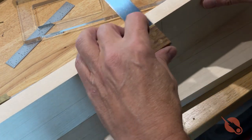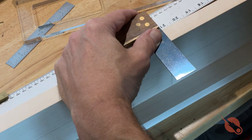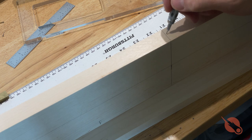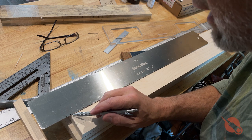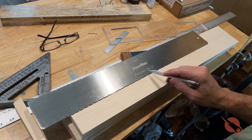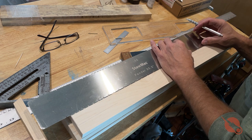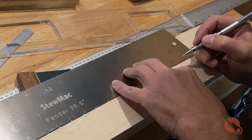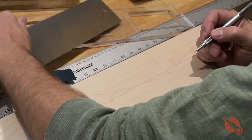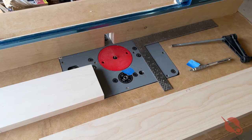Right now I'm making sure I know exactly where I need to stop the cut on the router — that'll be the outside of the bit. I always make the very end of my neck at the twenty-third fret. In this case I'm using the twenty-five and a half inch Fender scale because I like it. So I'm gonna mark where my nut goes. Alright, that's my nut.